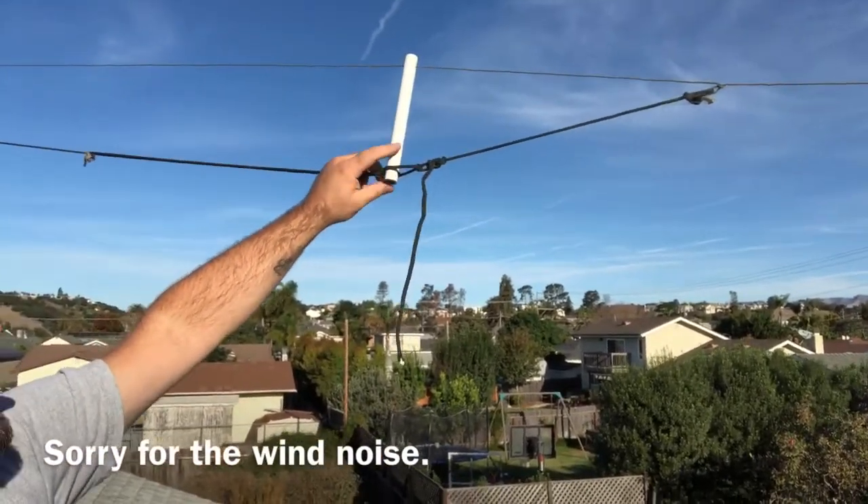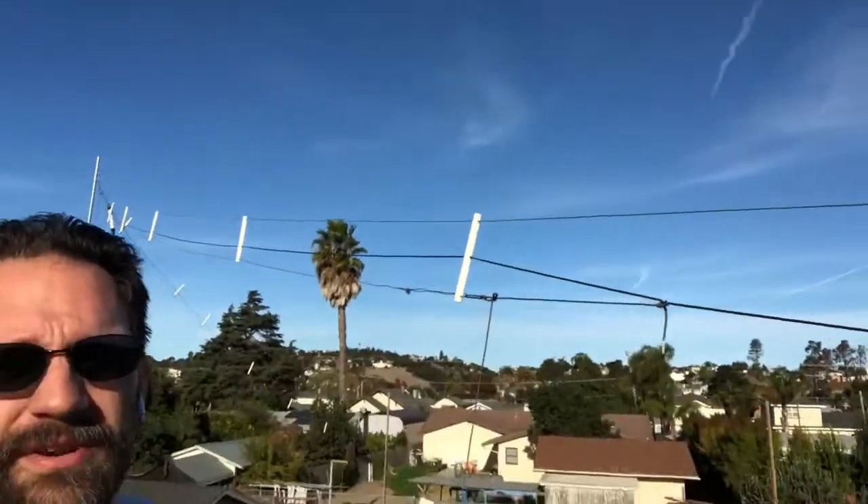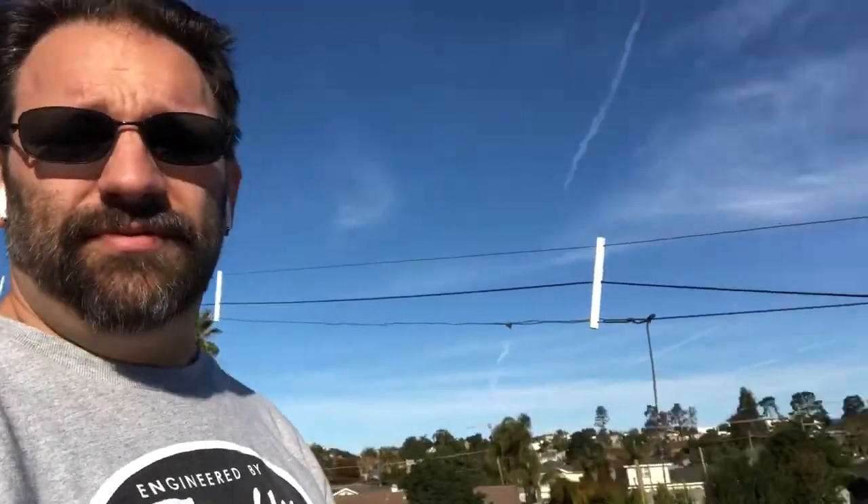I make the 80 meter section on top tight all the way across, then come over here and adjust this one to length and tighten it, then move to the next one. As you do this, the ultimate tension on the antenna is adjusted by the far end of the wire, and the tension of all the others is kind of the sum of it. Ultimately, tightening one makes the others a little bit looser — for guitar players, it's like tuning a guitar with a Floyd Rose floating tremolo, where tightening one string pulls the bridge up a little and all the other strings get slightly looser. It's kind of a pain, but you end up tending toward a tight and well-managed antenna.